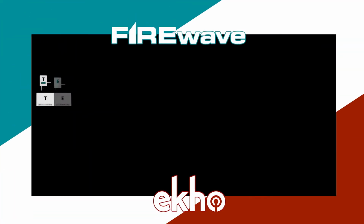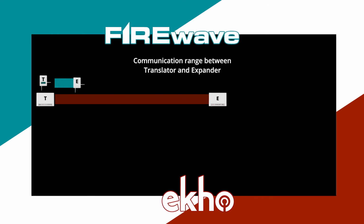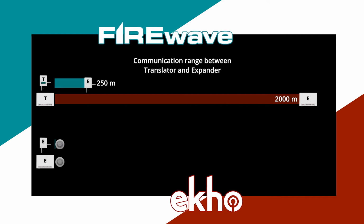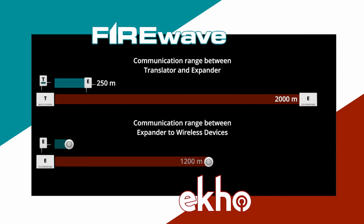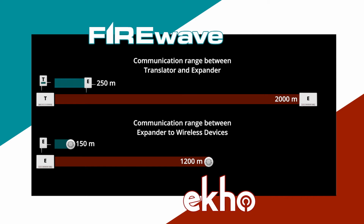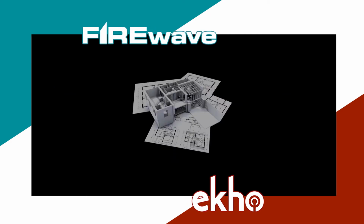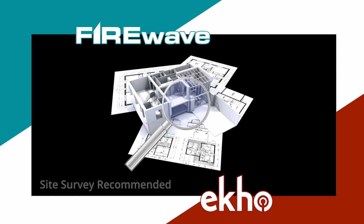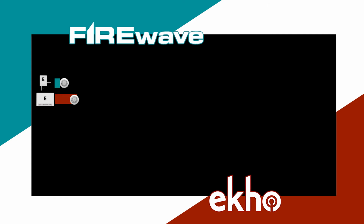First and foremost, the single biggest improvement with the Ekho system is in the wireless range that it can offer. We can see quite clearly on these two graphs that there are huge increases in both the distance at which the translator can communicate with its expanders and the communication range between those expanders and the field devices. And at this point, we should point out that, as with the FireWave system, we highly recommend that a site survey is undertaken to verify these distances on site.